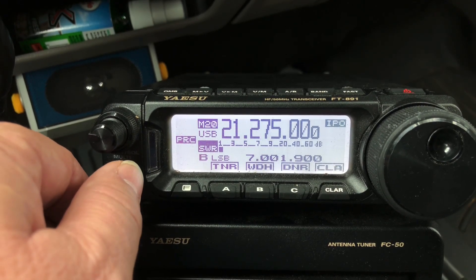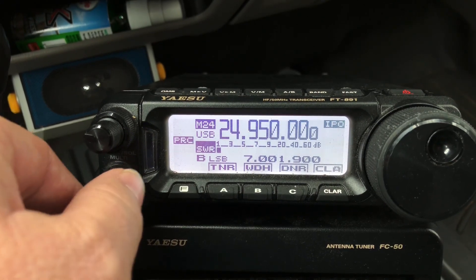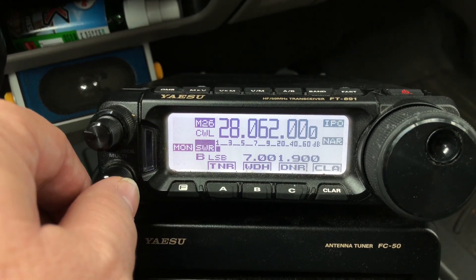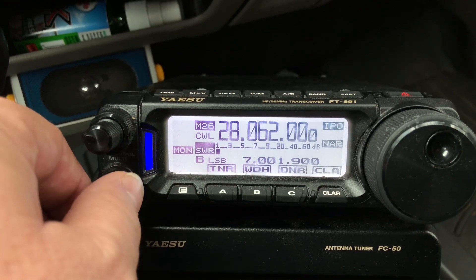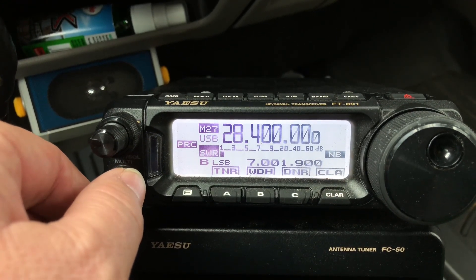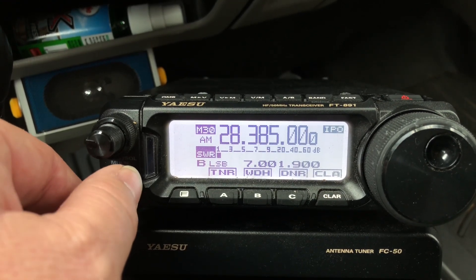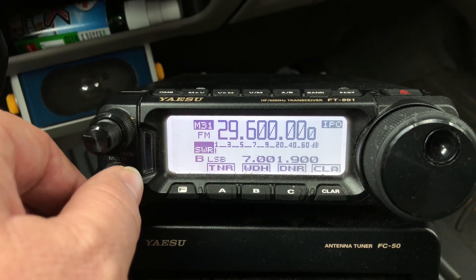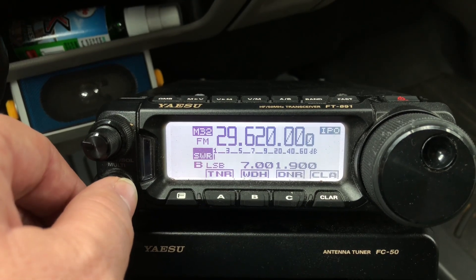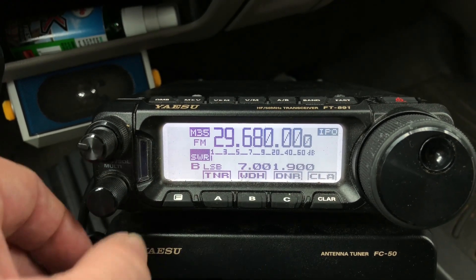Then sideband — kind of a lower end and upper end sideband. Then another AM, and 12 meters: CW, sideband, sideband. And then here we are on 10 meters. A popular CW frequency for summits on the air — 28.062. Again, if I'm on a base station I'm probably not going to run IPO. Then there's a calling frequency for 10 meters, sideband USB. And then a few other popular frequencies and an AM. Memory 31 is the FM portion of 10 meters — 29.600 FM simplex. Then 29.620 FM set for repeater offset and 100 Hz tone. And I repeat that for 640, 660, and 680 — those are the four popular FM repeater frequencies.